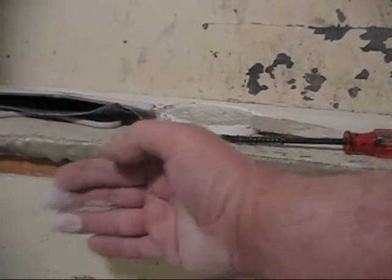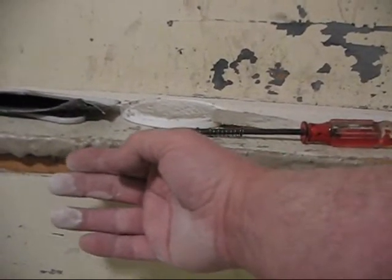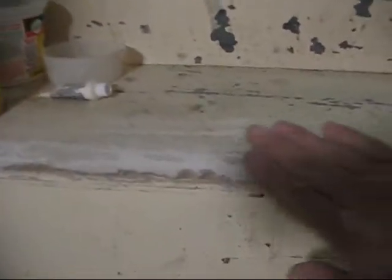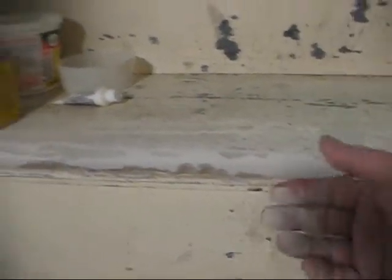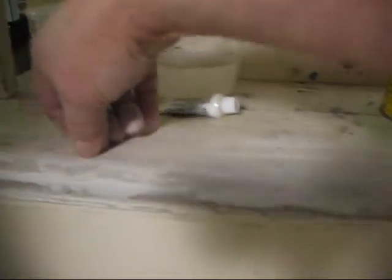You can see this one has quite a gash out of it, and my goal is to get the step out to here where it used to be, and I've done so on this one and sanded across the top. And this was broken off back to here. So there's quite a lot of step missing off of there, and I've got most of it back on there, and I'm working it down with a big bodywork sander, and it's coming along real nice.